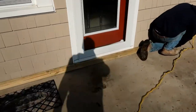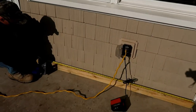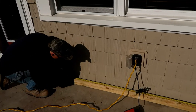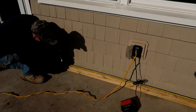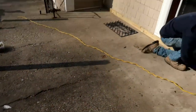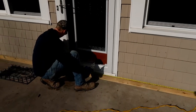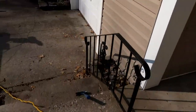That back porch is really level — we've already checked it with the transit. Luke is laying out our joist layouts now. These aren't really joists, they're more like sleepers — they're not going to be structural. If I used two-by-fours as joists this thing would be like a springboard, but luckily it's sitting on a concrete slab.